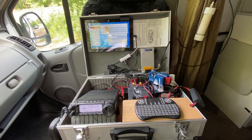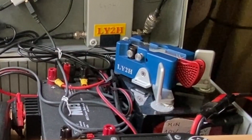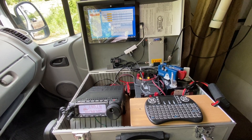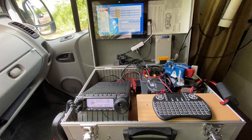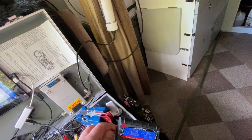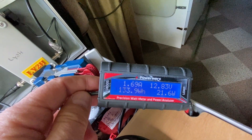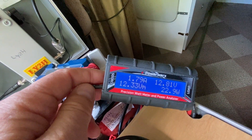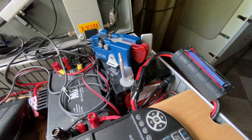The cycle of work was pretty heavy duty because I was working a lot of CW — the regime was pretty intensive. The one amp on receive doesn't matter so much because the radio was in transmit a lot. I had the watt meter and power meter connected to the radio the whole time. So, 12.3 amp hours consumed, and the battery capacity is 20 amp hours.